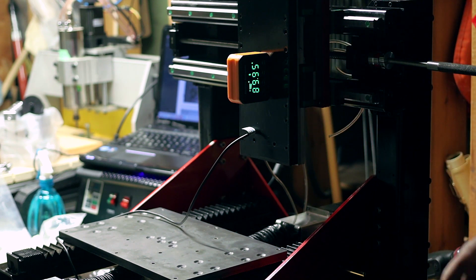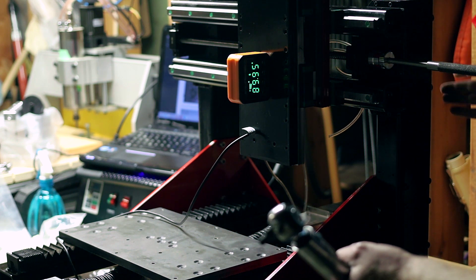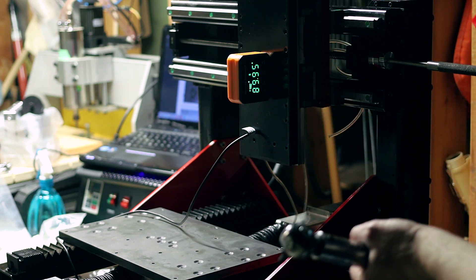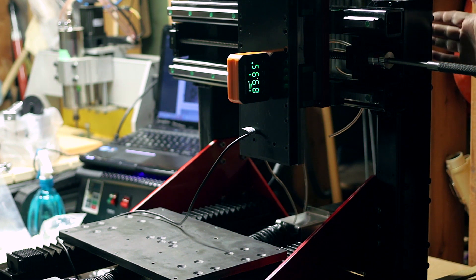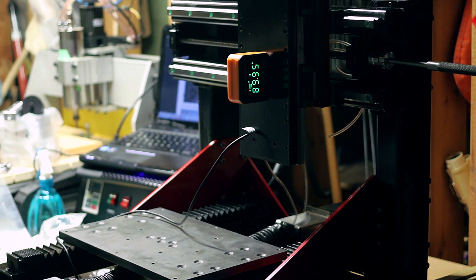This will bounce back and forth between 89.95 and 90 degrees. I tightened each of these bolts — 38.7 newton meters for a black oxide M8 is the minimum torque spec, so that's what I went with. I started alternating in an X pattern, tightening them up, and as I was getting closer to the torque spec, whichever way this needed to go a little bit, I would torque more on that side until it clicked, then snug the other ones up.